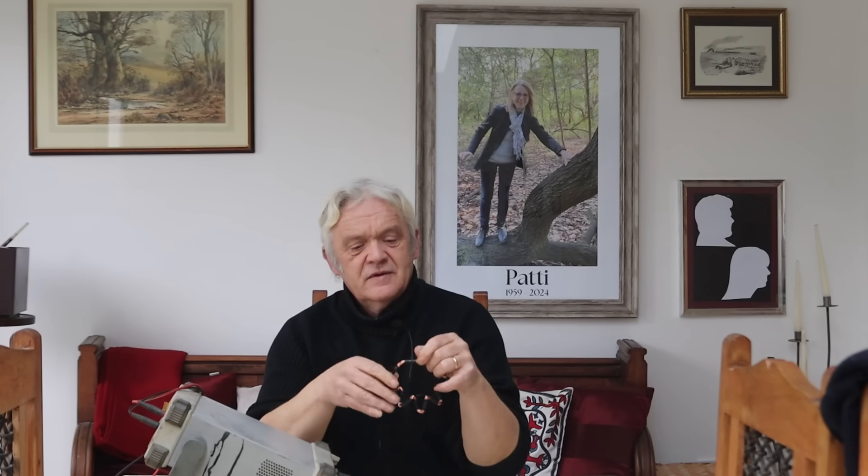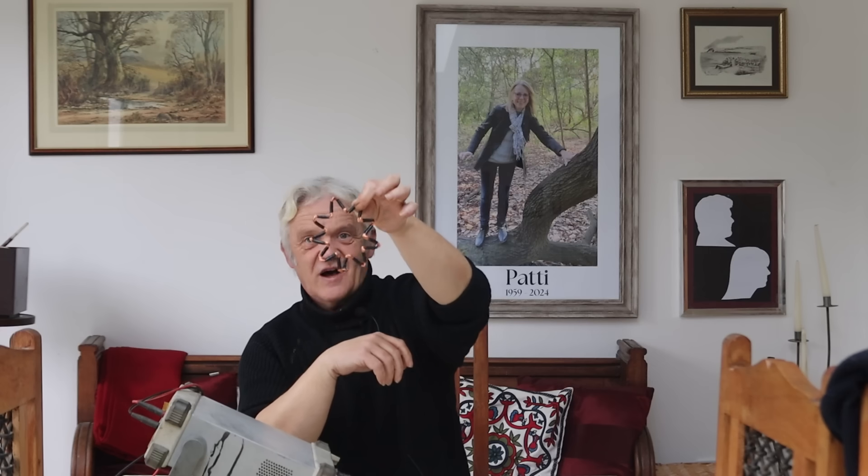Once you've got your coil, you need to bend it into a kind of star shape. The black plastic tape marks the main leg - the bend goes there and you bend it up so it makes a star shape. If you're not sure how to make the coil, check out my videos on making serpentine coils and making the coil winder. We keep on bending until the whole coil is bent into the star shape.